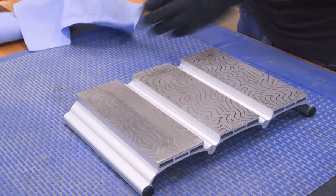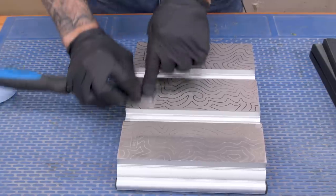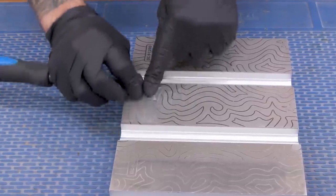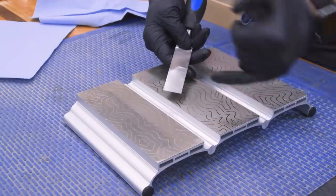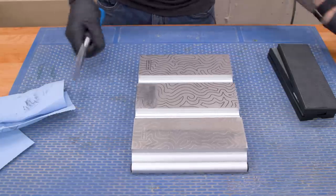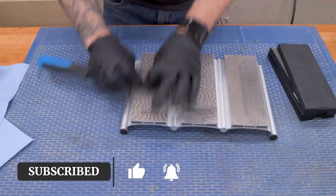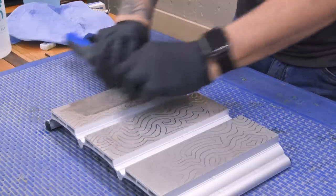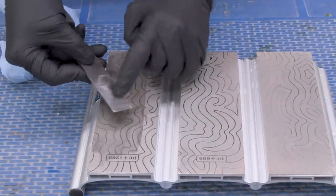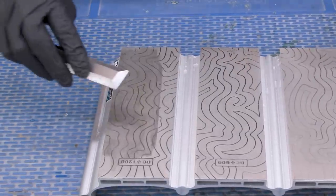I'm sure it'll work, but watch how short your strokes are when you do this. It's not a deal breaker, but I find it a whole lot easier and more enjoyable if I can address the entire length of a sharpening stone. What we're essentially doing now is replacing the previous scratch pattern with the new 600 grit pattern. Let's go to the 1200. That's looking pretty good — nice even scratch pattern. I'm not really going to take the back to the honing plates; I don't want to flatten the back on the strops as it seems like something that could wind up gouging them.